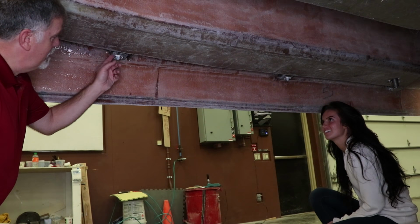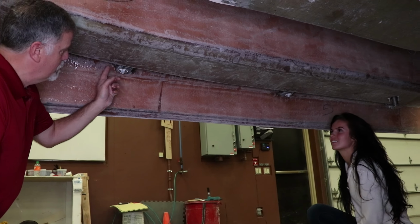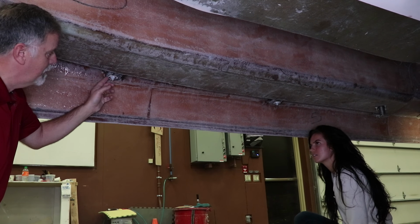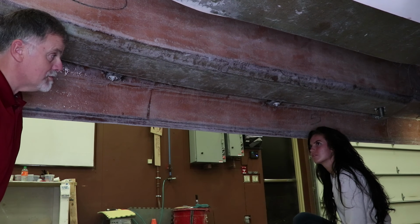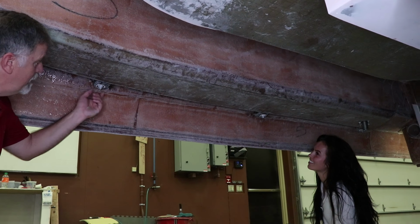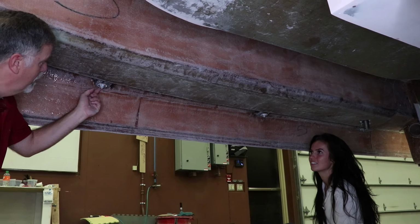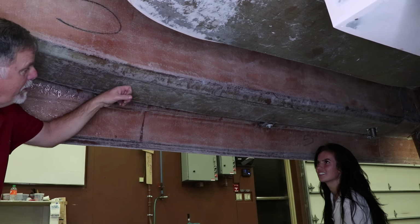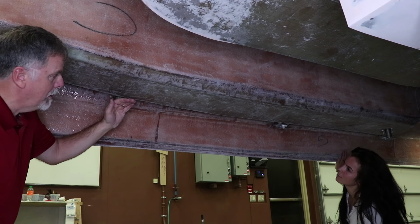And at every point where you have a protrusion or hole through the deck, you always want to seal it with urethane adhesive. This is an aircraft grade urethane, so really strong, really flexible, a nice watertight seal. And it's 800 pounds per square inch in tensile, so a pretty strong adhesive as well as a great seal. But you can see the deck trail here has been cored, so when you walk on it, it's super solid.